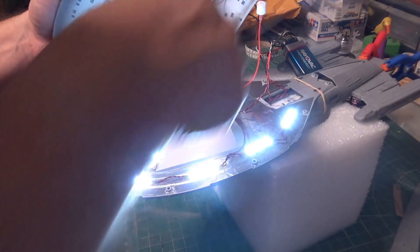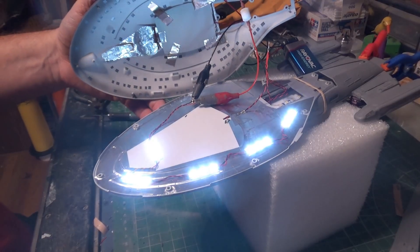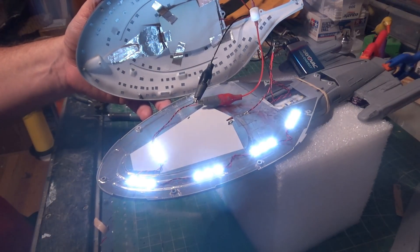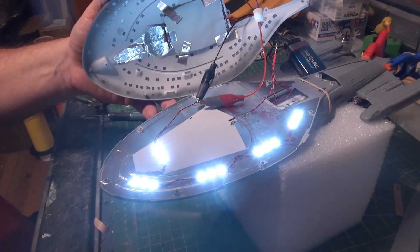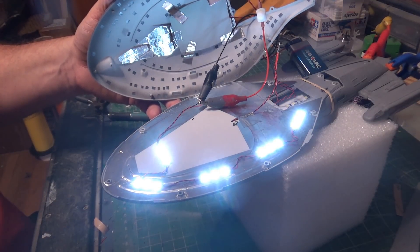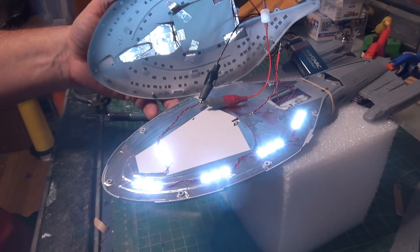Just three or four more single segments — that'll be plenty. Not only do we save bulbs that way, but it means eight times more soldering, which I'm not looking forward to. But it saves me on strip lighting and it saves the amount of power this thing is going to take. I'm still planning on running everything off a transformer — I don't think we can get away with a battery for very long. It'll run cooler and more efficiently, it just means more wires to solder and insulate.